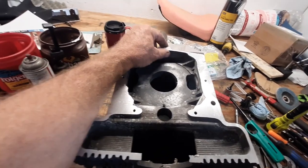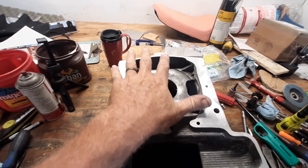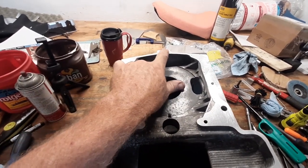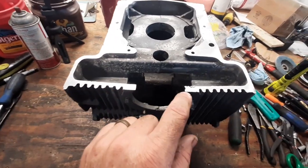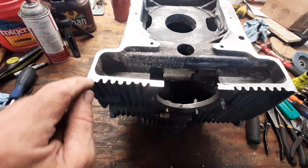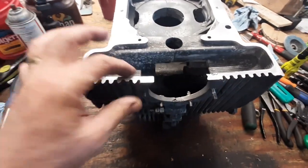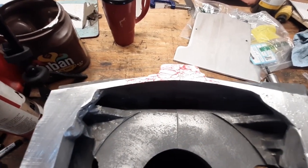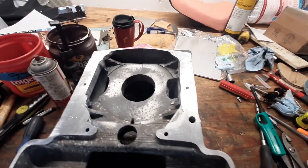What I'm going to do is start marking — put some grease on these spots, lay the plate on there so I can see exactly where I need to drill these holes, because you don't have much wiggle room here. The bottom will be real critical because they're a smaller screw and they've got to go in these little flanges here and then in the corner, so there's really not much meat to work with there. I'm going to put a little dab of high-tack grease on there, bolt that down temporarily, and see if we can get a transfer.